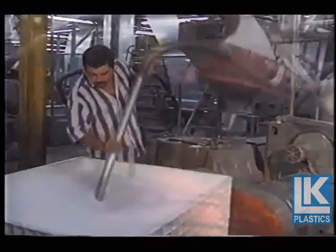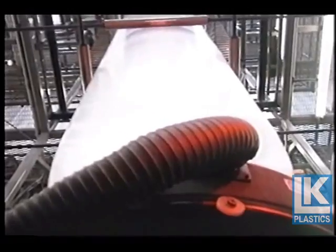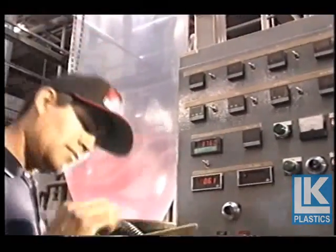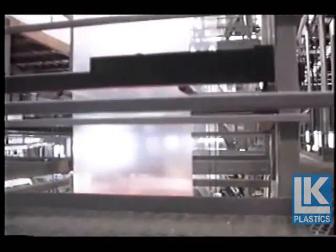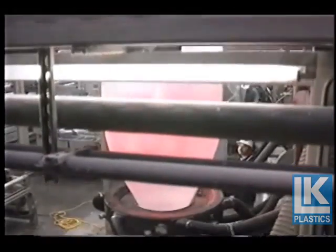Here they are fed through an electrically heated barrel, which compresses and melts the materials. During the process, plastic is heated, compressed, and forced out of a circular die at over 400 degrees and at two to six thousand pounds of pressure per square inch.